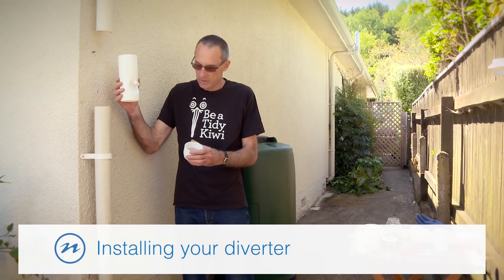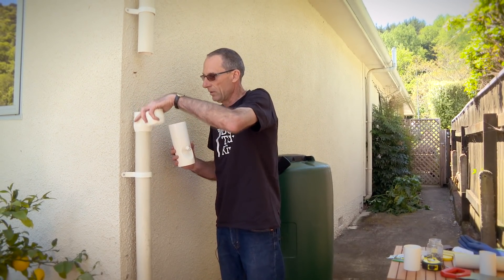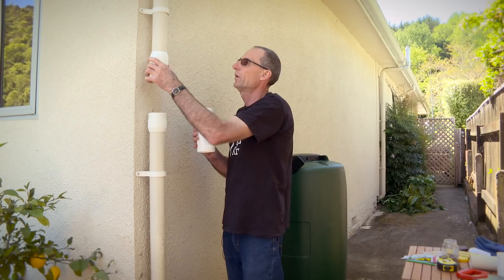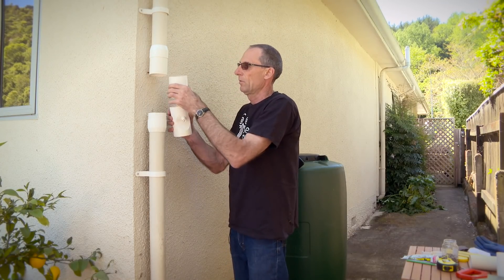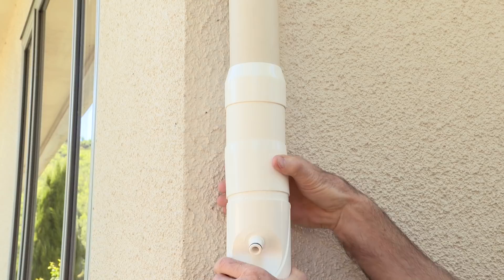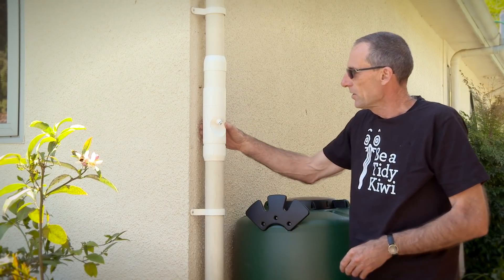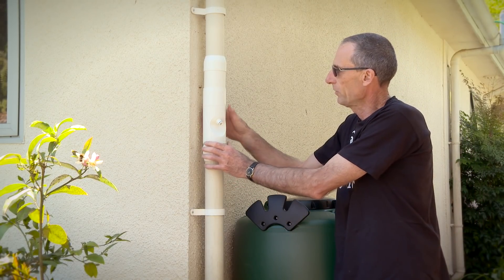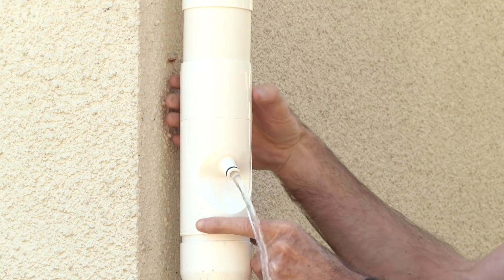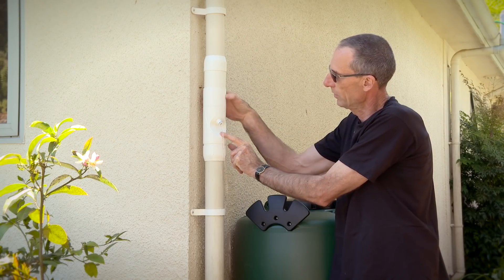The next step is to just make sure all our pieces fit together. I've got the first bit prepared — that goes there. We've got our 80mm extension piece that will fit up into here. This piece slides up here, this slides into here and slides down onto there, and we're all set. That looks like it all fits, so I can now glue these pieces in place. I'm going to demonstrate how this diverter works — it's very simple. There are a number of different types, but this one you just twist the top part around and out comes the water. Twist it around, turn it off. Very simple to operate. You either divert the water to the tank, or if the tank's full you can turn it off.